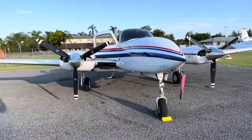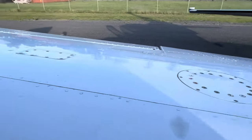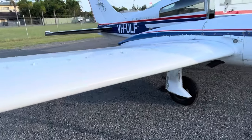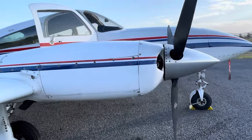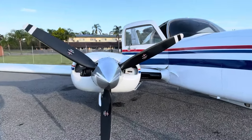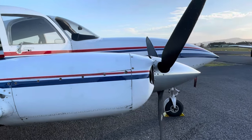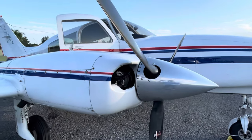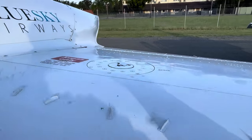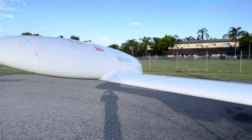What is sometimes misunderstood — and has caused several 310s to land in paddocks — is the auxiliary tanks, which are filled between the forward and rear spars and feed straight to the engine. Here's where it gets interesting: the engine-driven pump or the electrical auxiliary pump feeds fuel to the engine at a pressure higher than it actually needs. It has a relief valve and returns the excess fuel or vapour back to the tank.